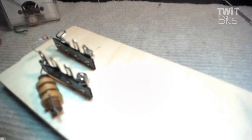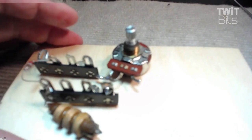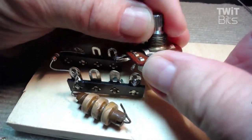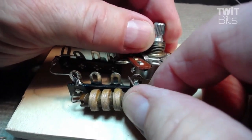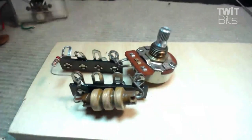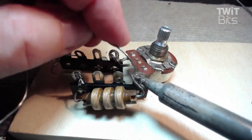Here comes the potentiometer. Now, one other thing, the potentiometer's tied together, the wiper and one side of it. So what we did here ahead of time is I mounted that so that we have the potentiometer ready to mount, and I don't have to deal that quickly. If we had more time, I'd do all that for you. So that's going to come over here, and the potentiometer is going to go in here, and we're going to solder it all together. And we're making headway.